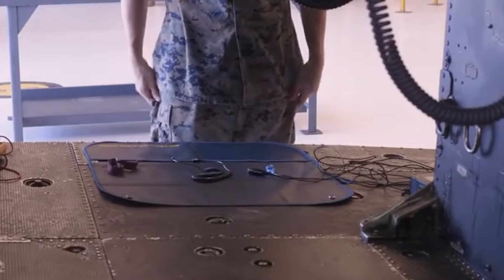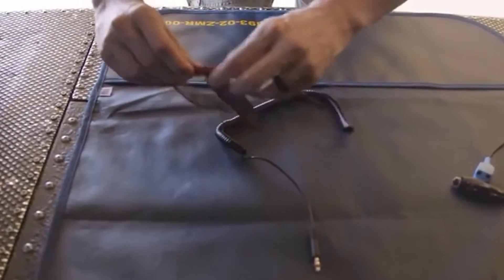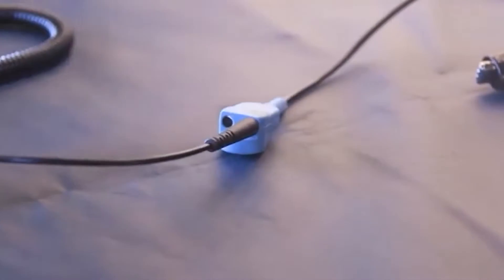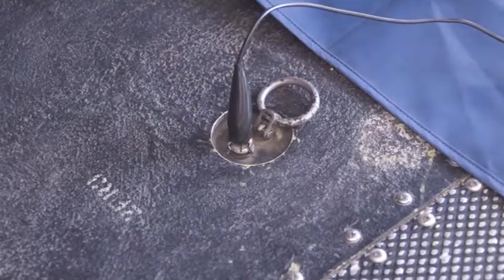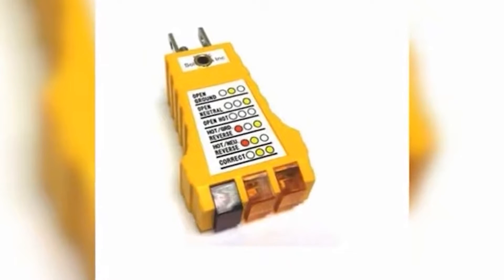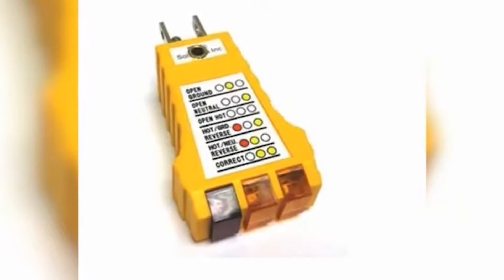Paragraph 4: Install single conductor ESD mat cord system for wrist strap only, or ESD mat with wrist strap used on aircraft. Connect wrist strap or ground cord to aircraft structure. Since we are using a field kit, we'll be attaching the wrist strap to the ESD mat, and then the alligator clip will connect to the aircraft structure. If an earth ground checker with NAVAIR 17-600-193 ESD-6-1 wrist strap jack is used, verify that the device indicates good ground by consulting the device legend. If the EGC fails, use it on another AC outlet; if it still does not indicate correctly, replace the EGC.